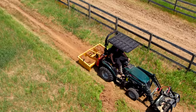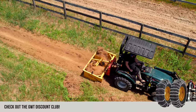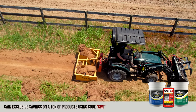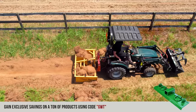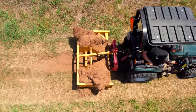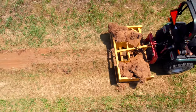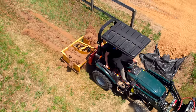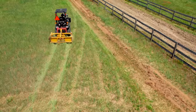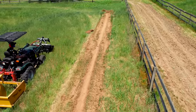And maybe you can tell by the dust clouds that are coming around, it's been dry around here for a while. The ground is pretty darn hard. What we're going through is just an old pasture, and you got to get to that sod, all right? That sod is pretty hard throughout there, and so the first pass is really more of a focus on just kind of using that plow point or that cutting edge to just kind of cut through that sod layer, and then the follow-up passes after that are where you can really do your actual ditching with that tool.